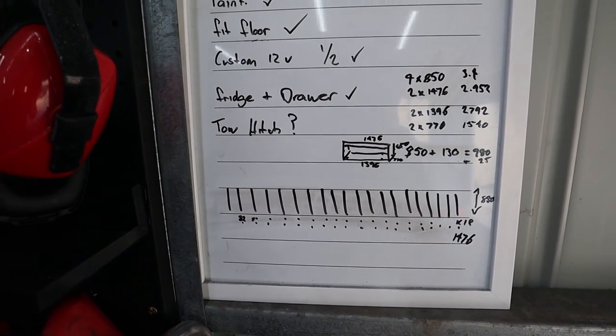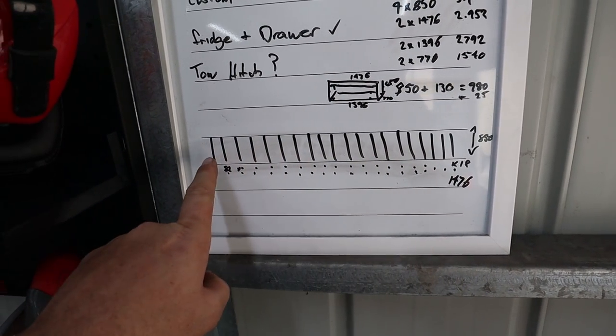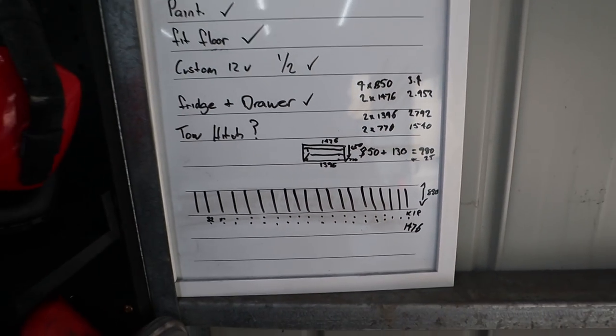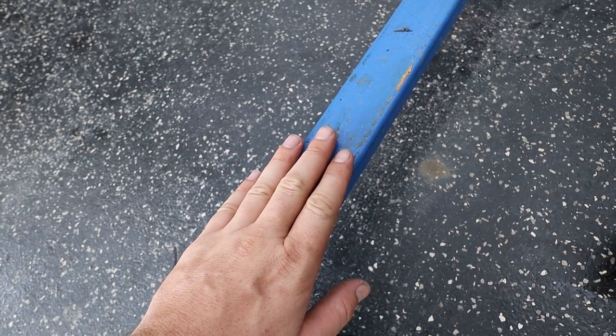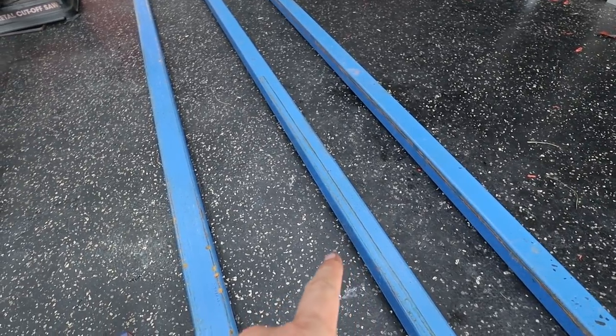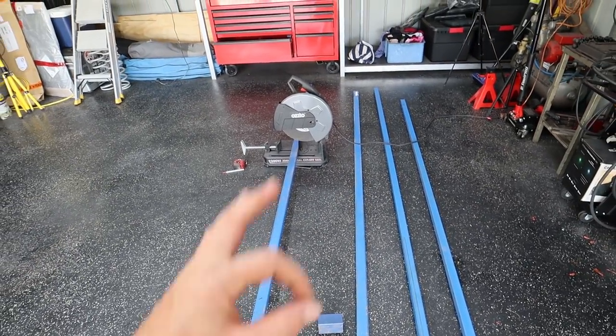Up on this whiteboard it looks very confusing, but I've just drawn out how many runs of steel I want. My perfectly drawn table right here is going to come to life. For the slats, the material I got is 50 by 25 wide, so it's nice and flat. For the legs, I got 40 by 40. They're both in 2.5 wall thickness, so this is going to be bloody strong.